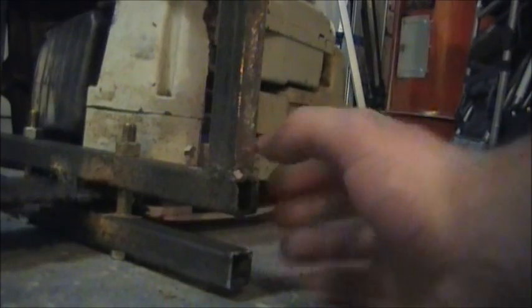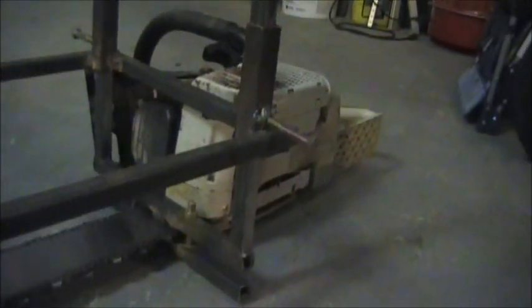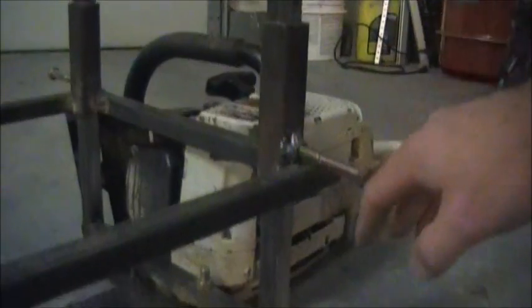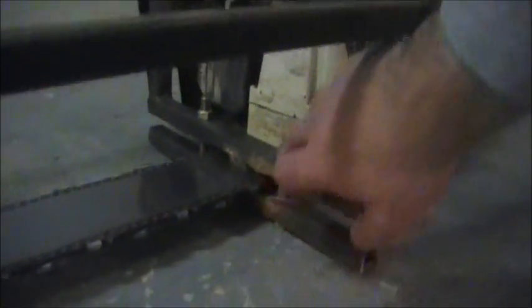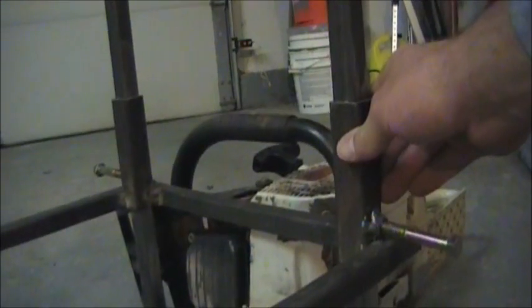The next thing that's important is to remember that when you line this up for your weld, you want to make sure that your dimension is correct at the base. You could make this piece as long as you choose for whatever depth of cut you're going to need — mine is around 16 or 18 inches. As you flex your square tubing down here, that is going to move the position of the top piece. Make sure that it is perfectly square at this angle, and that the distance between both uprights accurately matches the distance on your rectangular fence piece.